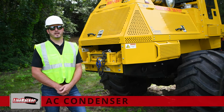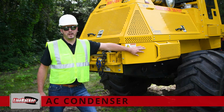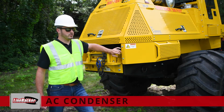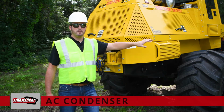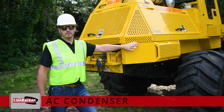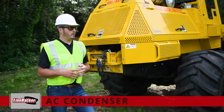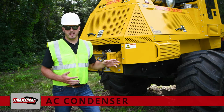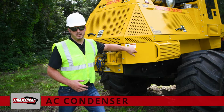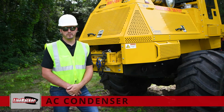Here at the rear of the machine on the right-hand side, we have our AC condenser located on a swinging door. So these two bolts, when you loosen those, this door swings out, makes that condenser really easy to service, wash out. Just like everything else on the machine, you want to try to blow that out on a daily basis, but if you ever do need to pressure wash or service that unit, this door, you can just very easily take a wrench, two bolts, and swing that open for easy access.